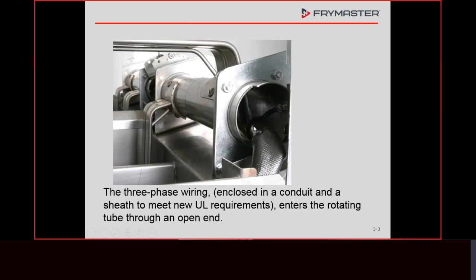Changing contactors on these is very tough depending on the fryer configuration, but I don't know of any time when you'd ever have to take off that tilt housing cover to change a probe. It takes about 20 minutes once you get access to the fryer to change a probe, if that. The probe wires from the factory are in insulation, but when you change a probe they do not have to go back in the insulation — just use the wire ties that come with it and tie it to the outside.